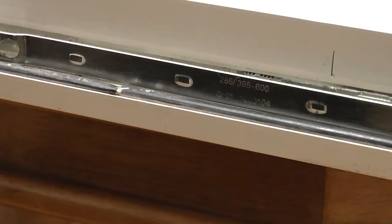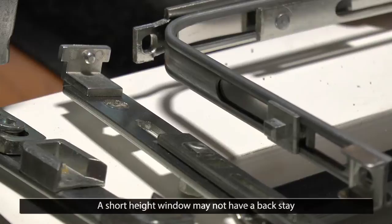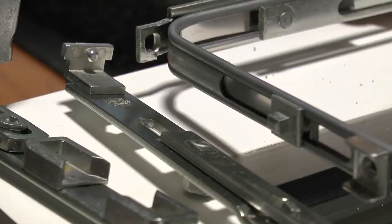Taking the back stay out of the height box — the last part that you need for going around the window — to attach it to the scissor stay. There is a hole here with a pin, there is a square hole here and a square socket there; the two need to be engaged together, and the two parts go together like this.